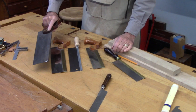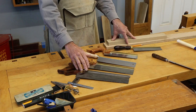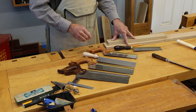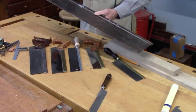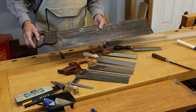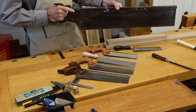There are several makers. There's some boutique makers in this country. And they're used, as the name connotes, for cutting parts in large furniture frames or carcasses. A still bigger saw is a tenon saw, and I've had this one for years. It really was first intended for use in an old-time miter box before there were chop saws. And these would run in a frame in the miter box and cut perfect miters. Saws this size are also used for cutting the cheeks of very large tenons.